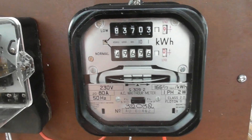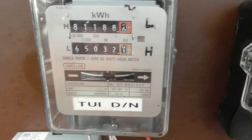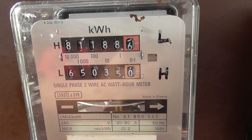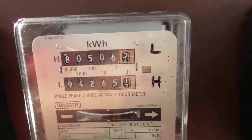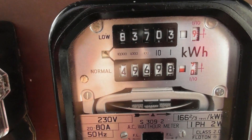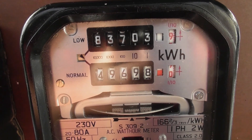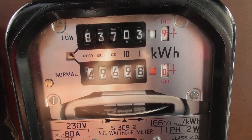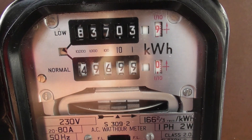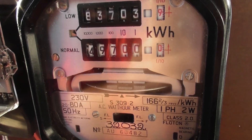That's a zero. That's on decimal two. That's on decimal one. Another intermediate reading — nearly 5.0, 5.1. It's going to roll over — I want to see the 700 click over here. So we've got one more unit to go and we're going to work out the error on these meters. Nearly there — click, there we go. 49.700.